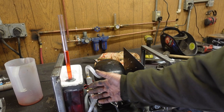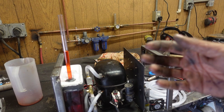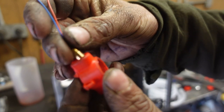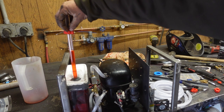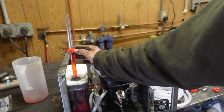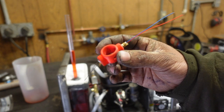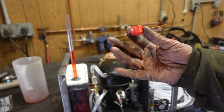We've done enough futzing around that the epoxy is dried now, and I've already refilled the container with some red Kool-Aid — it's just water dyed red. We have these 3D printed parts, which came out great. One side takes a laser diode, the other side takes a photoresistor. This slides onto the tube, we can stick a set screw in there and hold it at a certain position. Once the water level comes up and blocks the light from the laser diode going to the photoresistor, I'll be able to measure that on the Arduino — that's how we'll know the position of the water. Red water might not block this red laser diode very well, but if it doesn't work well we'll just throw some other dye in there and make a nice dark color.